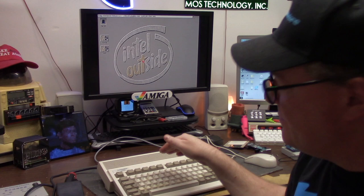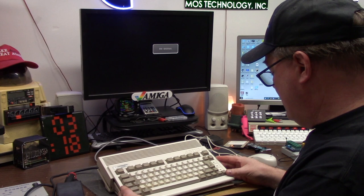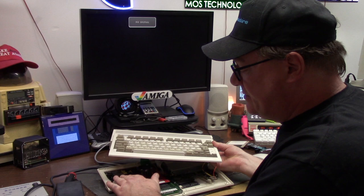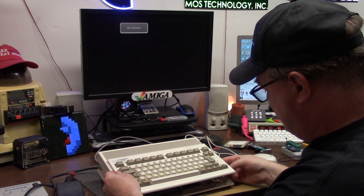It's the 2-chip model. If you have this card and you're having weird issues where it won't boot anything but 3.1, go for a Transcend industrial grade compact flash card. I only got a 4 gig, and that's totally fine for me. I am also using an adapter that is called Amiga CF-IDE adapter. It is a 44-pin angled. It was like $13 or something like that. Maybe more. I forget.